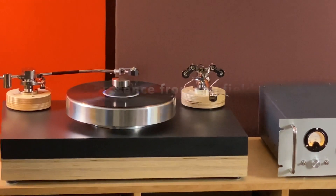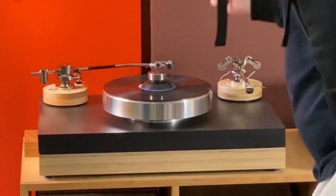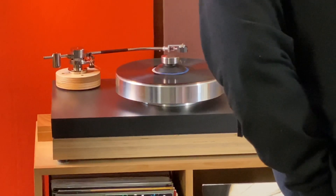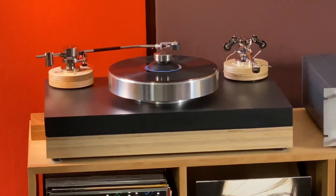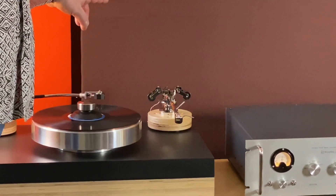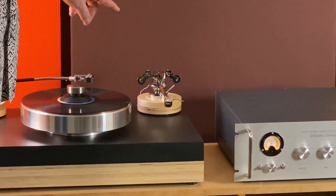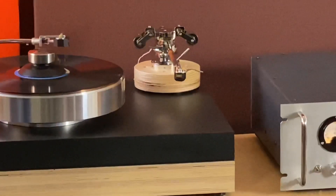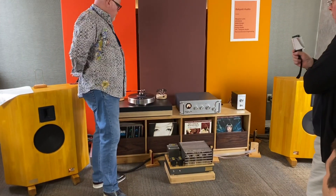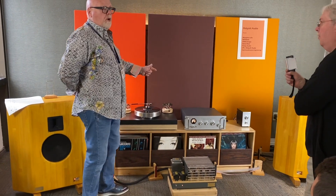This is the world premiere of the Thai Scandinavian Engineering Bird tonearm — that is the back left — and the Bird of Prey, that is on the right. They are magnetically stabilized, viscous damped unipivots, but they feel and work like gimbaled tonearms. The Bird of Prey comes standard with either a surface mount or SME mount, your choice. It comes with a 12-inch straight fixed headshell arm wand and the 12-inch J SME connector arm wand as standard. It comes with 1.8 meters of cable, which can be supplied single-ended, balanced, or field coil — your choice.